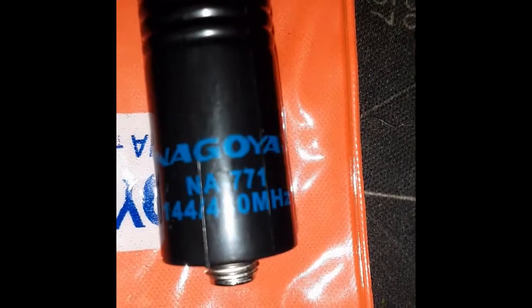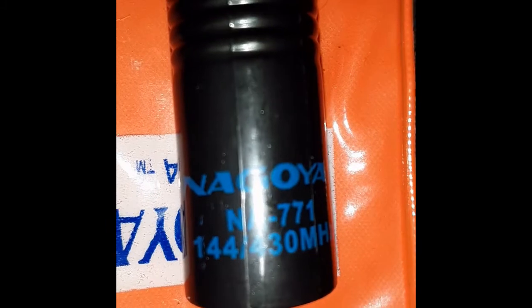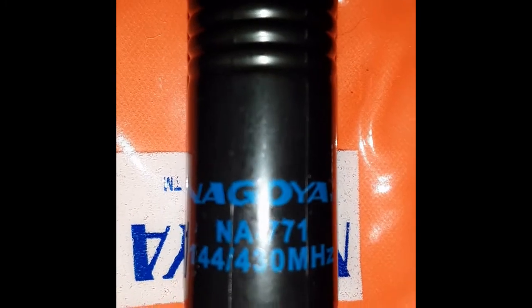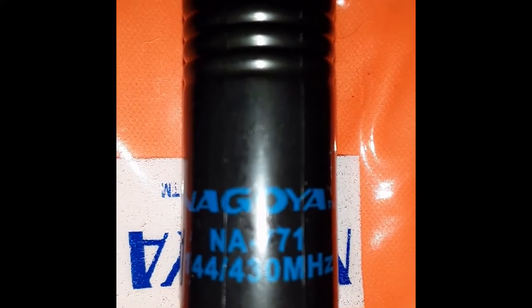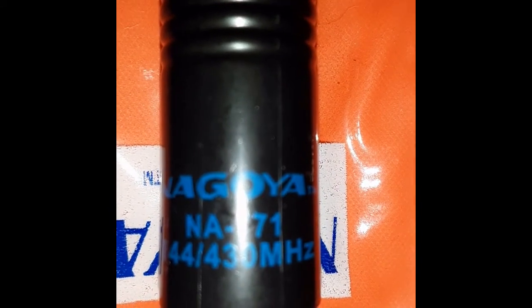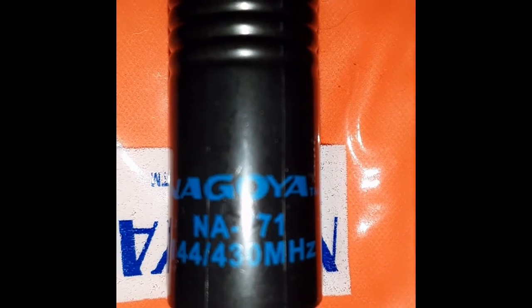I've snipped those back with side cutters with great success, then just took a little file and cleaned up any burr. Anyways, these are simple effective antennas. I had one on a UV5R one time in a Walmart plaza downtown Barre, Vermont, talking into the Birch, New York repeater — probably 45 to 50 land miles away — and I was getting into it at five watts, full quieting, where it took me the mobile rig at 50 watts.